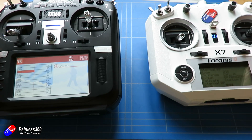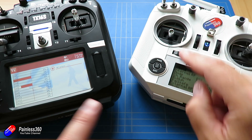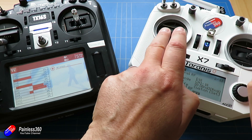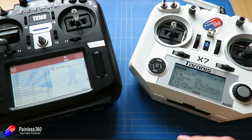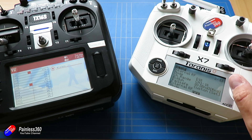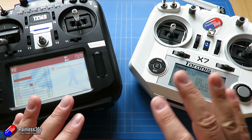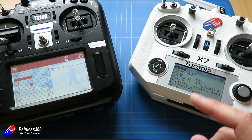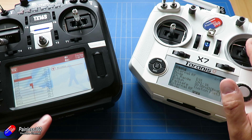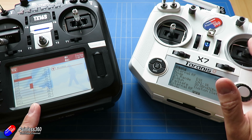So here we have the two radios turned on. They're very close to each other so it keeps losing the trainer signal, but if you keep your eyes on this screen — there we go — all of the controls have been passed across. And if I turn on the trainer function on the radio, then those controls also go on channels one, two, three, four as well. So that would mean that I could control the model from this radio. This could be very handy if I wanted to hand control over to my friend — I could flick the trainer switch — or if I just wanted to have them wirelessly connected so they could control something like a camera shutter or a gimbal. This could work quite nicely for that as well.